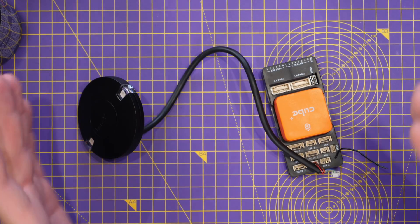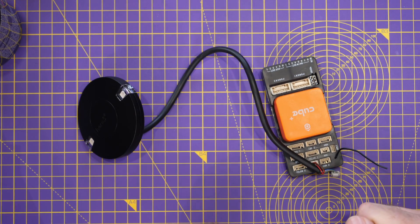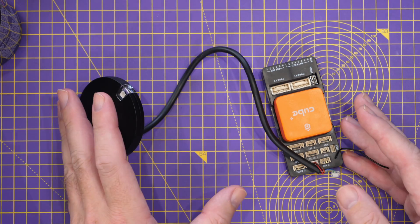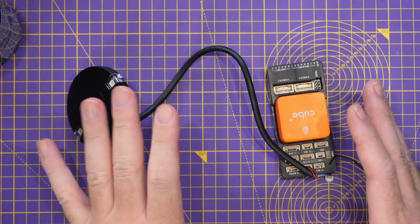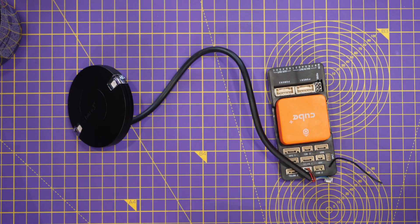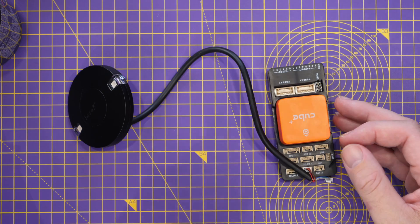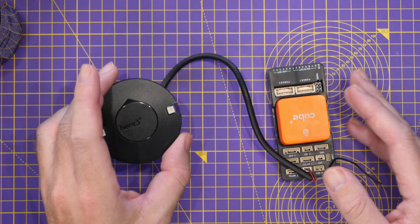So that is it for the Here 3 setup — it's working. We can see it on the CAN bus port and all of the configuration options for it. The real nice thing about CAN bus compared to the old UART port is that you can put multiple GPS devices on one port. You can use a CAN bus adapter to put them all on the same port as long as they've got different IDs, and then you have that serial link setup allowing you to put CAN bus all over your UAV or aircraft. We're starting to see more and more of this happen, with more devices supporting CAN bus.